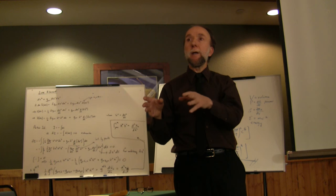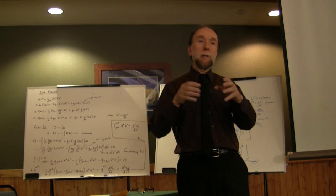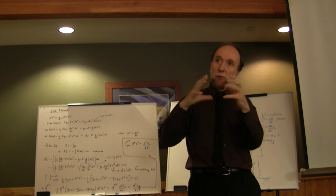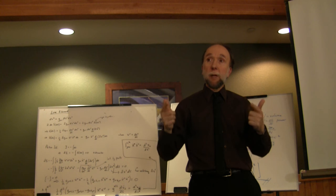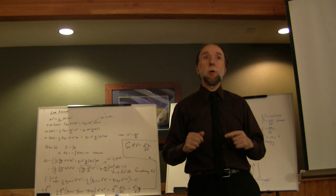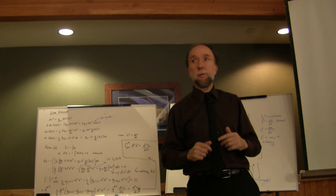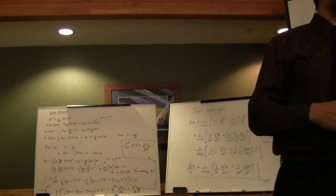Second problem after that, I would say damage. You want these things to last a long time. And fatigue is very bad. Not only do you have the electromechanical effect of the piezoelectric stack going back and forth like that, you also have thermal effect. It's very bad because the material properties of this material, remember, are temperature dependent, and they have a Curie point where they even completely lose all their electric properties. And believe it or not, if you take a look at just a few degrees going up in temperature, your fatigue life can be very much affected. So there's also thermal soak back into the brass since there's no cooling mechanism.